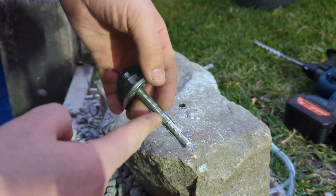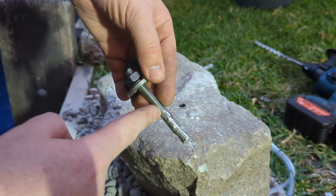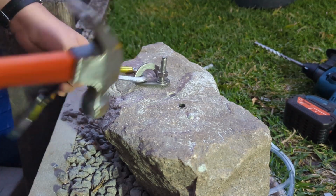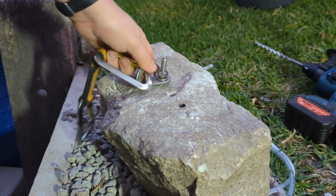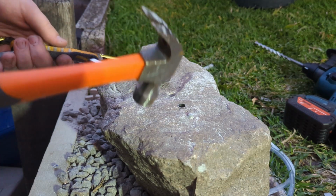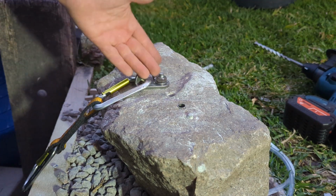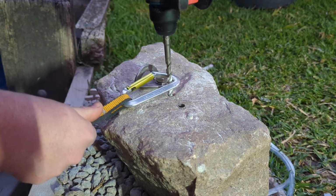And something else to consider with wedge bolts is once they're in past that actual wedge clip, they're not coming out. So that means if you're bolting on lead, you can actually get yourself clipped on there, start hanging on it, start taking a rest before it's fully in, because that bolt is set. You can't really do that with the sleeve bolts. So if you're going to be bolting on lead, maybe that's a nice strategy for you. It's going to be a lot less sketchy than clipping the bloody drill bit.